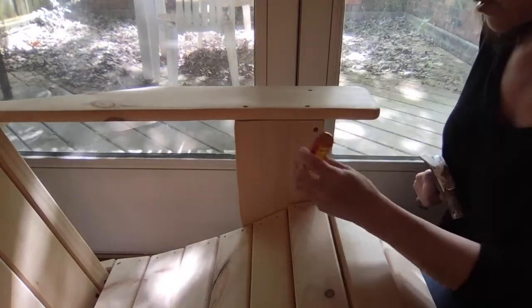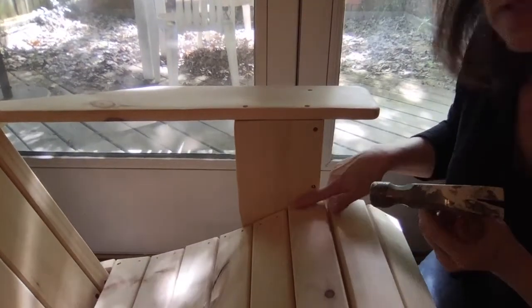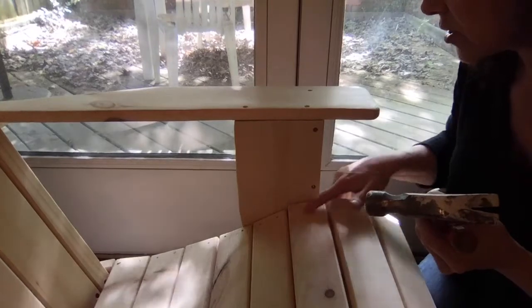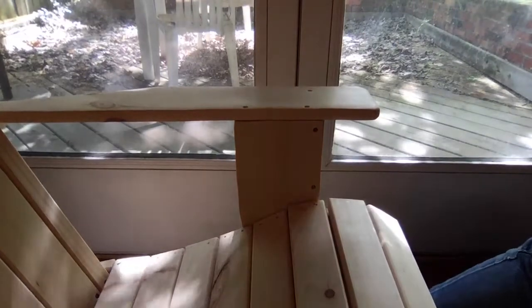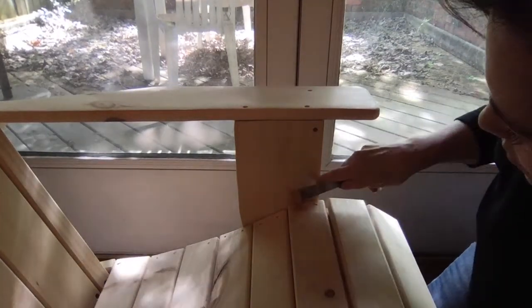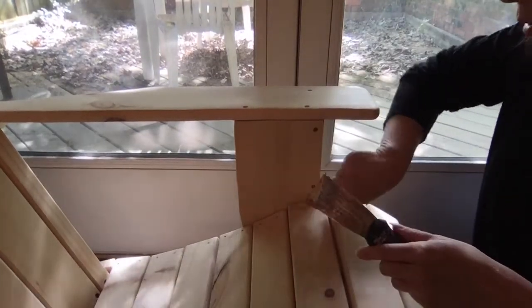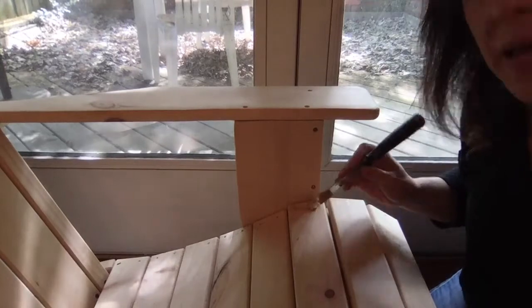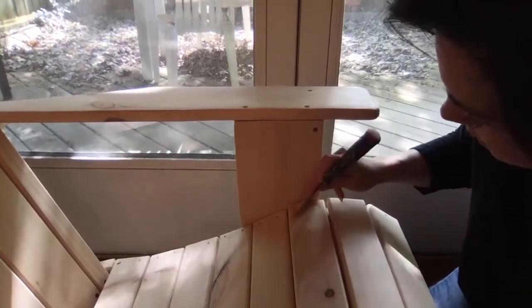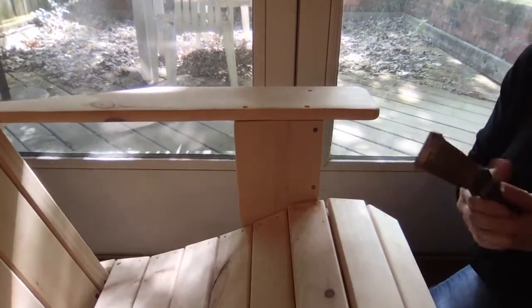You want to tap the nail lower so it's not flush with the wood, because you want to be able to fill it — the plastic wood will fill it flush. Use small amounts; you don't want to get it everywhere. The better your prep, the better your base, and that includes finishing the nails.